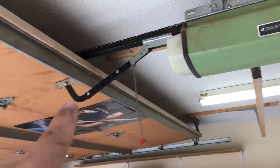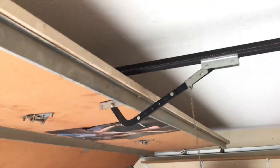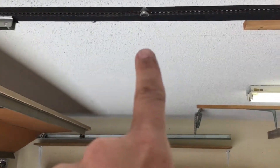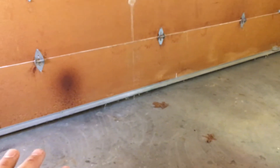There's a switch here and that's for the down side — so you have another roller on the other side of the chain and that's the switch that tells it to stop when it gets to the floor. So it doesn't stop actually by resistance — it'll actually stop when it hits that switch.